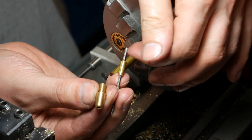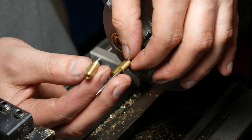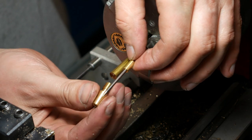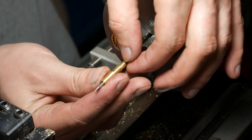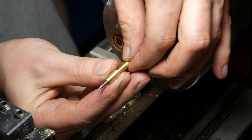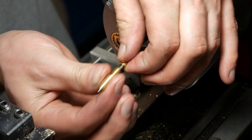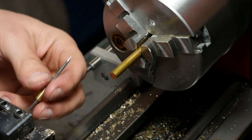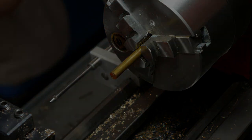And then the extra bit of the cutter will go down that storage hole. I guess we can call it a storage hole. Then when you thread the tip down the body, it comes down and locks against the front of the bushing. When you have the bushing sized to just the right length, the cutter can't move forward or back, so it locks down nice and tight. You don't have any play in it. And that's what I need to make right now. So I need to take this bar down to 3/16, drill it and ream it so that the cutter will go through, and then cut about 1 inch of it off.